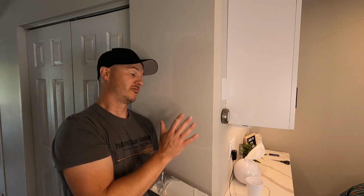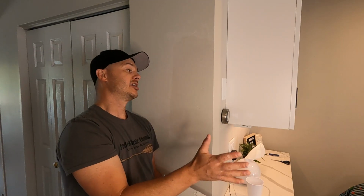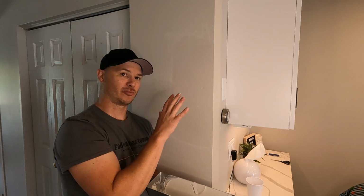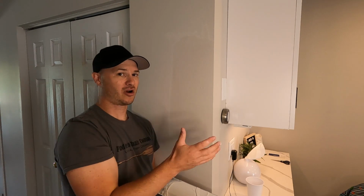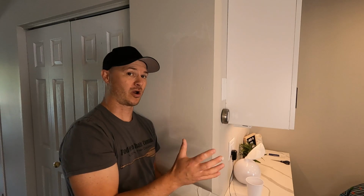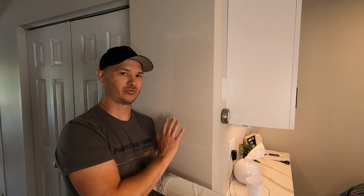Now, if you've done a poor job underneath and you got some high spots and it's not great, and then you put the compound on and you try to sand, you may sand through, and the 20 and the compound, they're gonna be a little bit different. The 20 is going to be a little bit harder to sand than this compound, so then you're going to have issues sanding it, and it might cause you more problems than you want. You may as well stick with 20 if you're not going to do a good job on the underside coats.